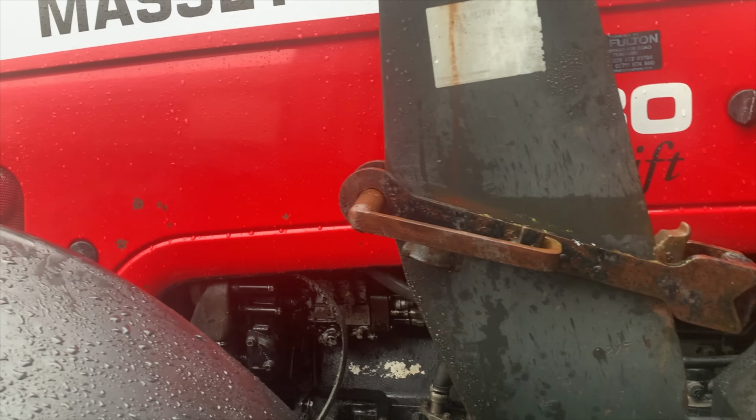And now the 6480 is back in action. So Lee has played a blinder for us, he has the injector pump sorted. We didn't have the timing cover changed, which is brilliant. There's a bracket to be put on the back of the pump, which takes the vibration out of it, which is part of the reason why they went. It was on the later models of the 6480, 05 and 06, that it was on. This is 04, which was the first of the 6480s to be made.